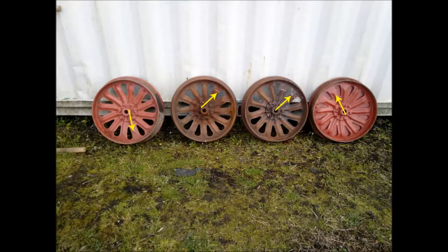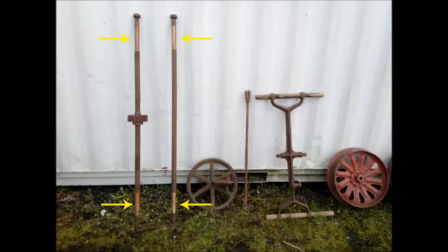Unfortunately, parts of the wheels had been left in soil and had actually rotted away. Luckily, Tony Simons took them to college and got the students to repair them. Both axles were also bent, but luckily Tony got these straightened out. He also bought new bearings for the axles and turned the ends of the axles down to fit the new bearings.